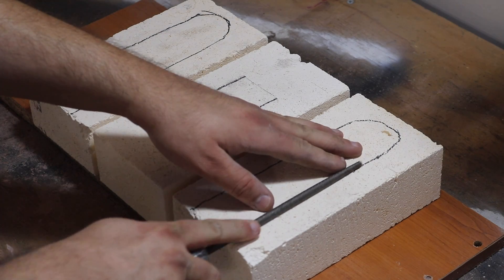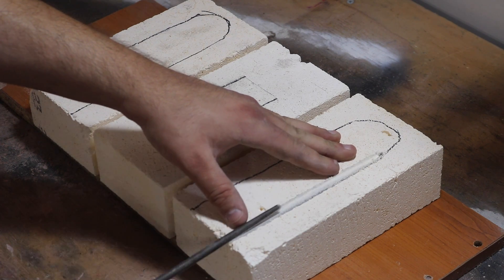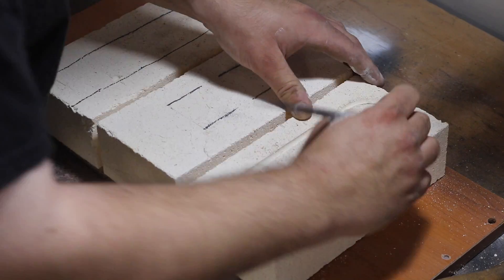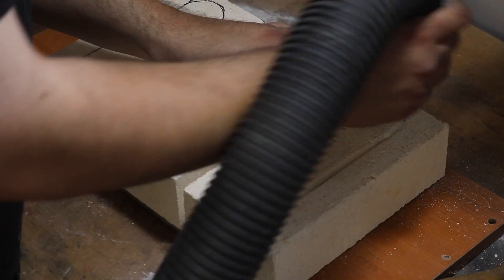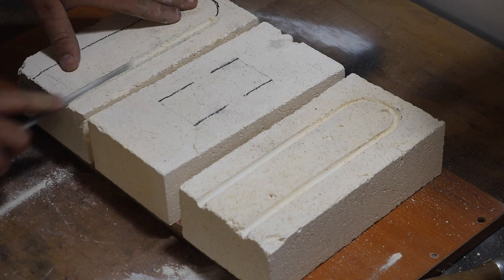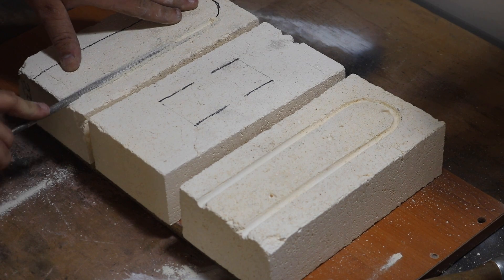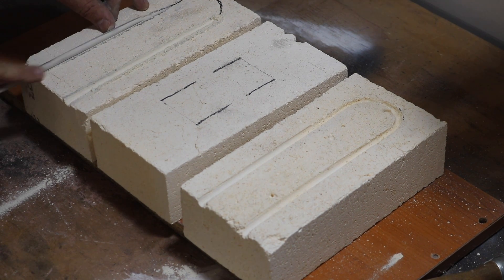While the base cooled, I hit the bricks. Before they could be laid into place, I had to carve the trough in them for the heating element. I laid it out in sharpie and then carved the bricks with a file — any hard implement would cut into these bricks, they're very soft. The dust coming off of them is extremely horrible for you, so I was cleaning them constantly and wore a respirator the entire time, which was fun on a hot day.